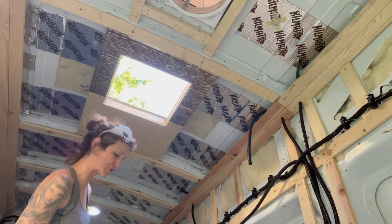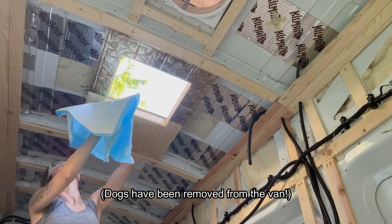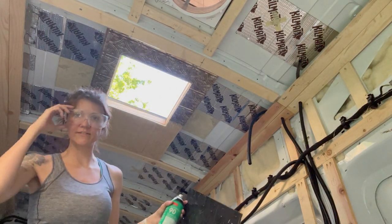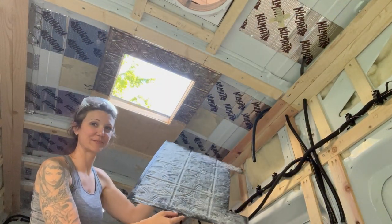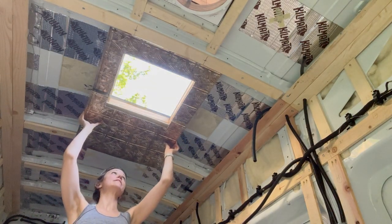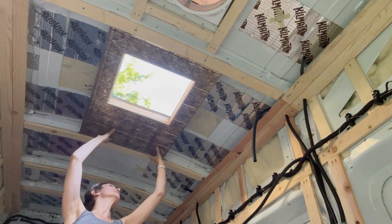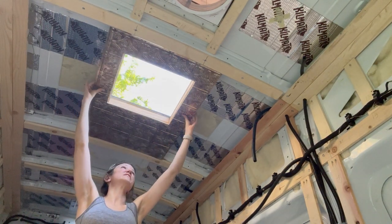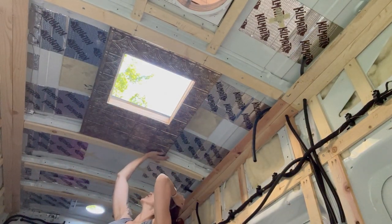Now I need to glue these pieces on and then I'll actually be able to install the skylight. I'm using spray adhesive — it says to use tube adhesive, but this stuff is awesome and I'll have other things holding it in place anyway. Following the instructions: spray onto the piece first, then onto the panel, let it get tacky, then stick it up there. I have my door open for ventilation. I applied the spray adhesive generously and up it goes — I thought I was going to have to clamp it in place, but it seems fine.